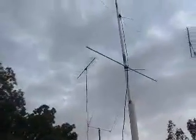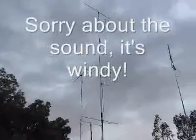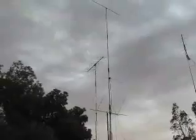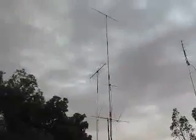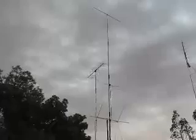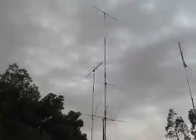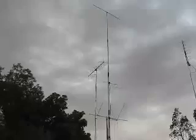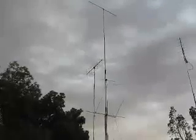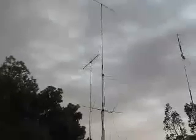Now we can see the antenna. Found this antenna on the internet — quite an interesting design. It's about 3m tall, about 1m wide at the top, fed about what looks to be about two thirds of the way from the top, or a third up from the bottom.